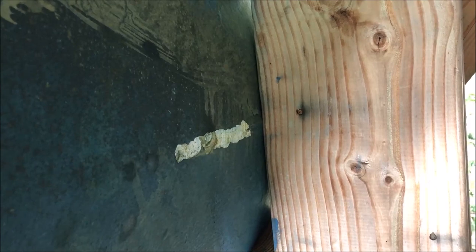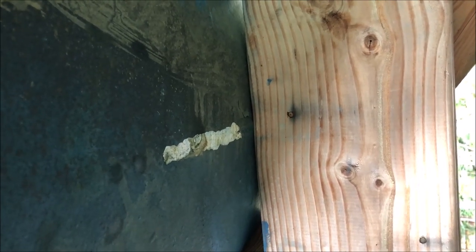There's a little owie up on the bow that needs fixing. That little gouge in the keel is probably where it sat on the trailer and it was not in the V-block. So we'll want to sand that back, fill it, and put some epoxy on it and then some bottom paint. Otherwise, that's an invitation to corrosion of the iron.